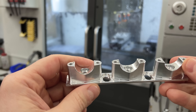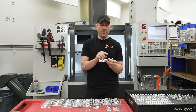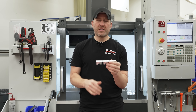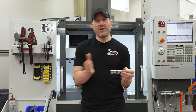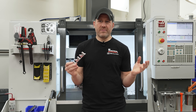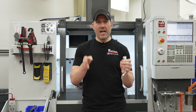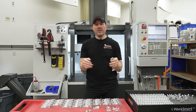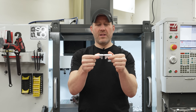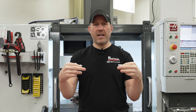So I have three of these bad boys right here and I just snap them apart like so, so I can put them in my vice. Some of you may be questioning why not put all three in the vice just like they are and clamp them — part of the problem is you're probably going to get one that's thinner than the other and then one's going to rip out. There are times where I've done five and five parts in a vice, but you're always going to have one rip out at some point. To make sure everything's perfect and you don't ruin your jaws, I just make sure I have two parts on either side as far apart as possible. If I had a part that was snapped and this wide, I'd want to snap them apart and put them towards the edge, because the farther you are on the edge, the better grip force you're going to have.